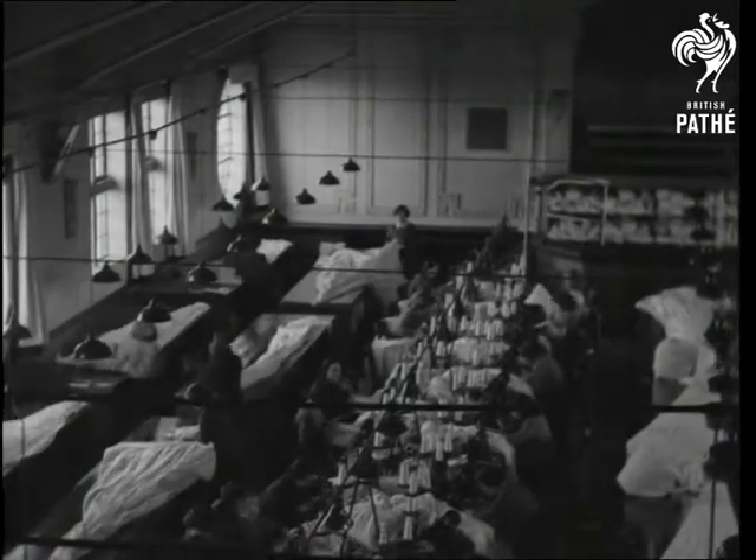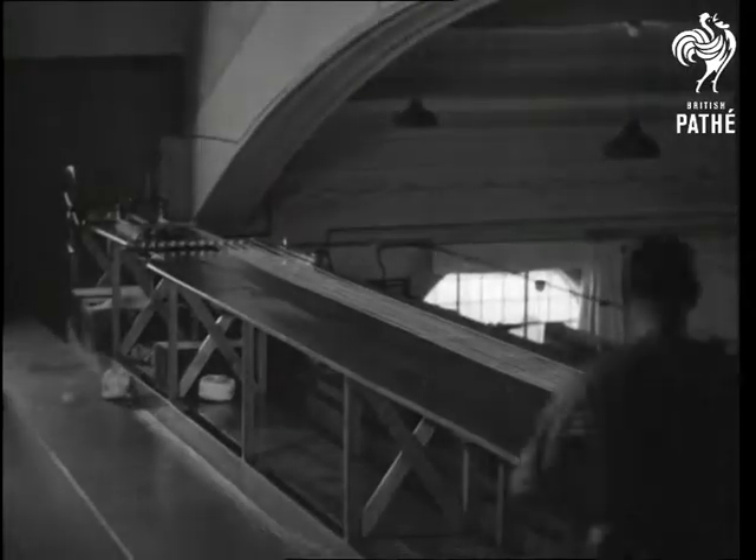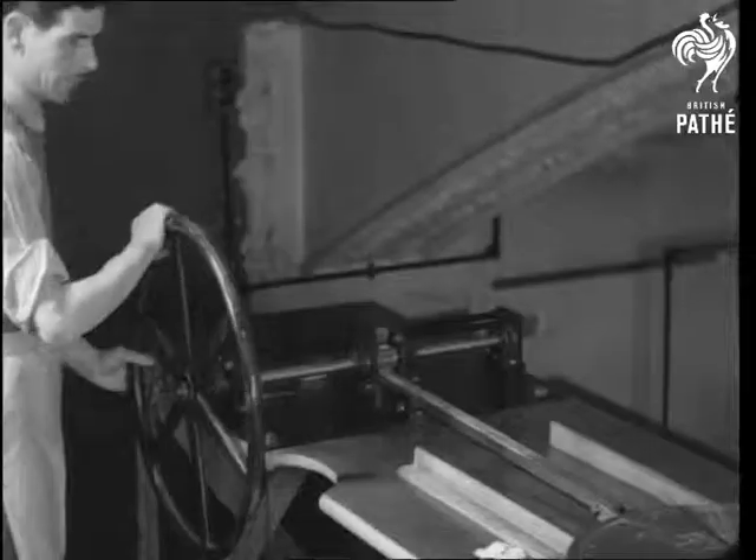The suspension or shroud lines are silk cords entirely free from knots and splices. They're stretched on a machine that also makes them of uniform length, and like the body and harness, each cord is tested. It has to be able to pull 400 pounds.